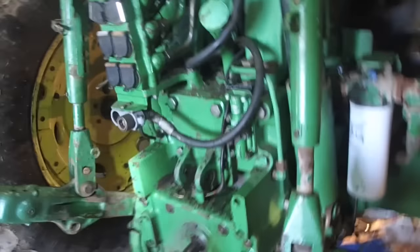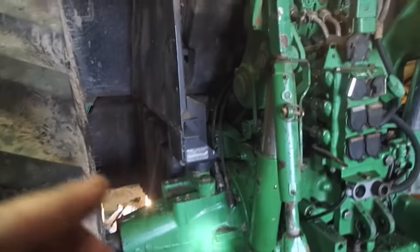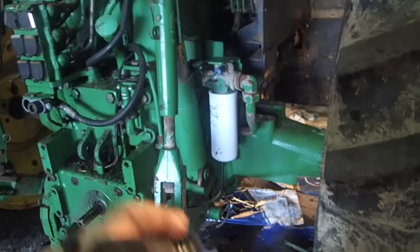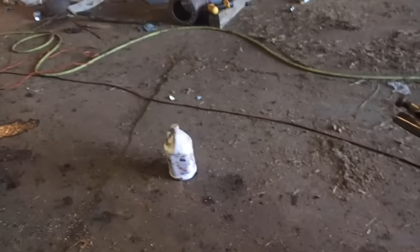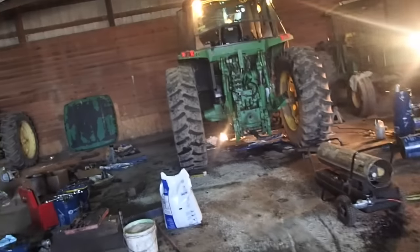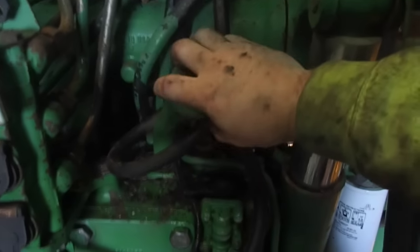We have no oil in the sight glass, so we're going to have to put oil in her. That actually sounds pretty good. I'm not seeing any oil leaks now at all. I have not hooked up my loader linkages yet because we're going to be replacing that. And I haven't hooked up the hydraulics on the loader. Timothy hasn't gotten the shifting linkage hooked up yet either, so that's another issue we have to contend with. Tim's going to pump oil — put it in the one-gallon container, do one gallon at a time until it's full. We're just going to let it run a while before we make any other adjustments or finish hooking up the linkages, because I really want those clutch discs to soak up really nicely. That's the plan — Tim's going to put oil in here and I'm going to go back to hooking stuff up.